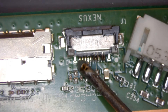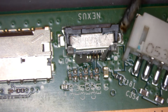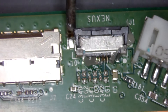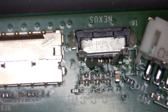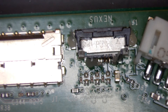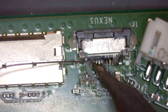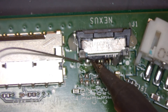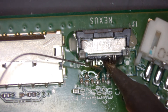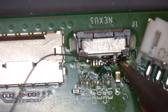So let's give that a go. We're going to add some flux all the way along here — flux to these pads as well — and then come in with our leaded solder and soak the entire area with some nice leaded solder, making sure we get these little pads here as well. Obviously this connector is damaged so it doesn't really matter if we damage it anymore.